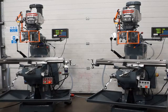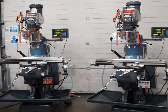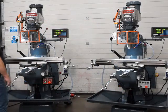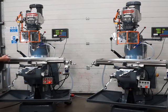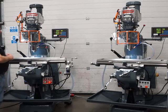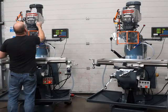They're both running together, both feeding down around 800 RPM, LED lights on both, both in really great condition - super smooth, absolutely beautiful machines. They've had all new lube systems, brand new lead screws on both, and they've got a three-axis DRO on both. That one's tripped out in the quill, this one's about to trip out now - there we go, tripped out fine. They're running absolutely beautifully all the way up and down the range.